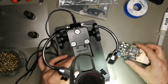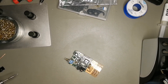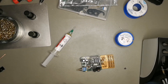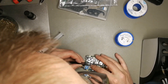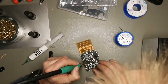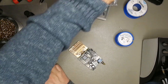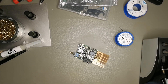Here I'm checking all my capacitors under the inspection microscope and I found out that one of the capacitors sits a bit wonky — too wonky for the German in me. It doesn't sit properly on the pad so I had another go and took that one off again. Same procedure: cleaning the pads, getting rid of excess flux, applying fresh flux, and trying to get it on straight the second time. All the heat is not good for electrolytic capacitors so you should not work with the soldering iron for hours, but generally using a soldering iron is still less heat stress than using a hot air station.